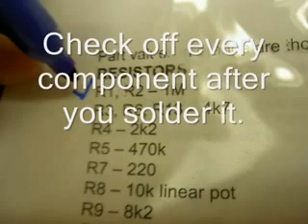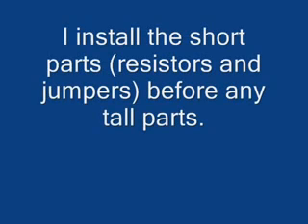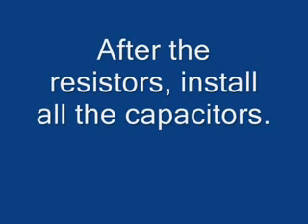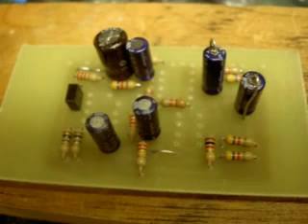After you do your work, just check it off the list. I keep a printed list and I check everything off so I don't get lost. I install the jumpers and the resistors — this is a picture of what it looks like with everything done. The bare wires are jumpers. After the resistors, I install all the capacitors. Electrolytic capacitors have a polarity — a plus end and a minus end. Make sure you point the plus in the right direction; the short wire is always the negative end. This is what it looks like with all the caps installed.